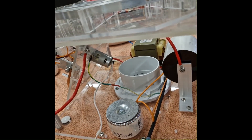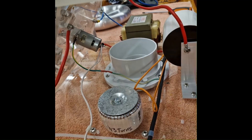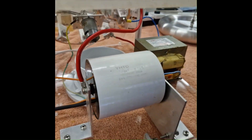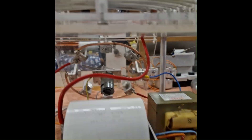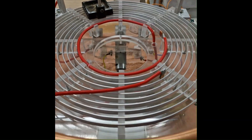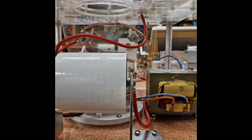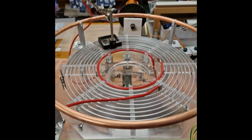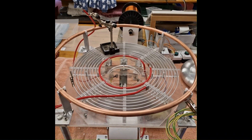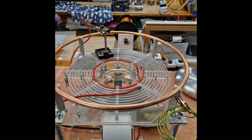So we've got everything wired up: the low voltage mains wire into the inductor to the microwave transformer, 12 volt running the rotary spark gap, and then the high frequency circuit involving the capacitor, the rotary spark gap which is right at the back there, and the primary coil which is up here - aluminium primary coil - using large diameter cable to account for the skin effect with the high frequency circuit. And we've installed the primary coil. In one of the other videos I showed you how to make one of these aluminium flat bar primary coils, and you might want to refer to that.